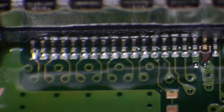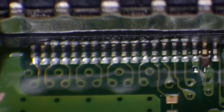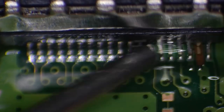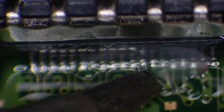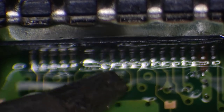I seem to have lost the 0.1 microfarad capacitor — that thing always blows off, it really is annoying. But it's not actually needed. It's a 0.1 microfarad smoothing capacitor and it's genuinely not needed for functionality — it won't affect the display at all. I've actually been asked about that a couple of times by people who've lost that capacitor, and every time I tell them a 0.1 microfarad smoothing capacitor isn't going to affect the console in the slightest.